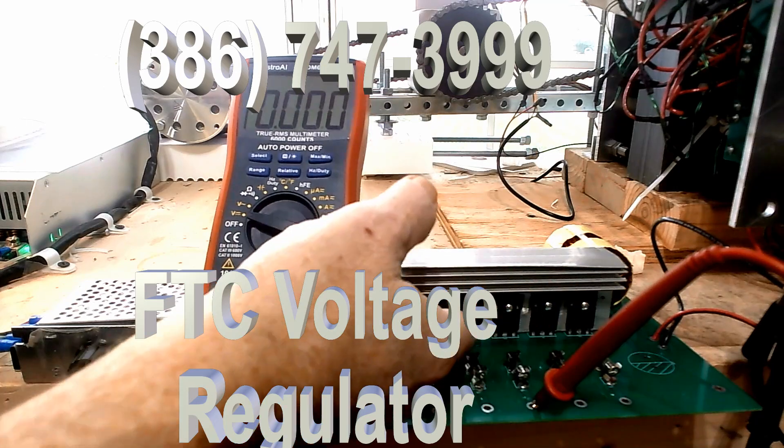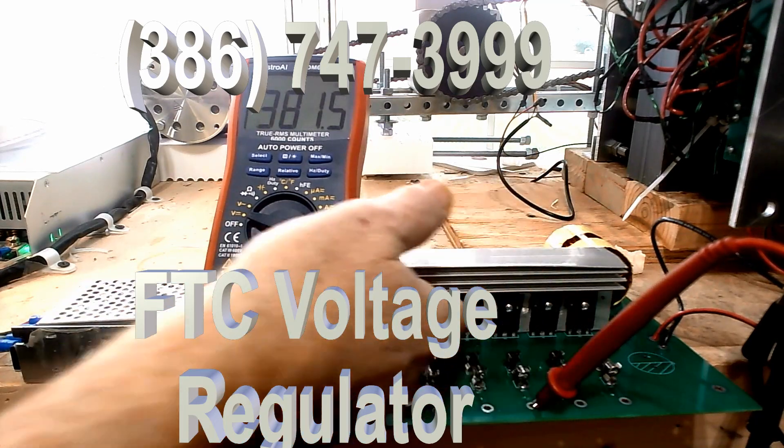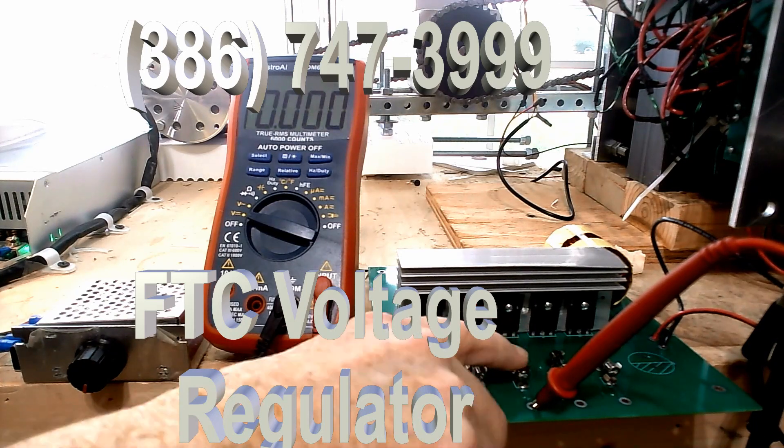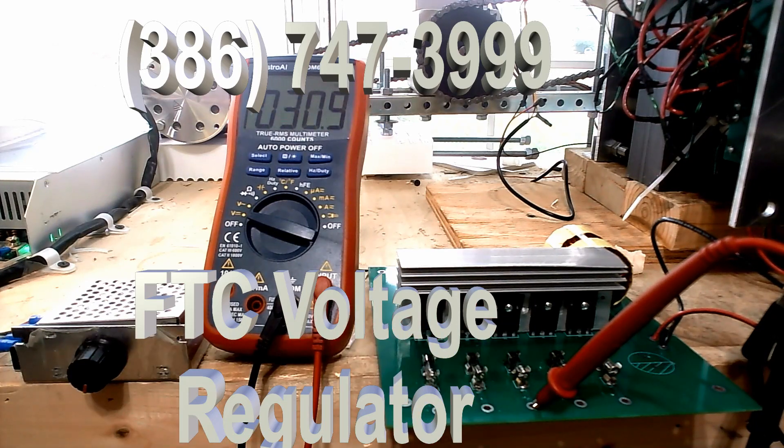What I've got here, these MOSFETs — metal oxide semiconductor transistors — are rated at 600 volts and 47 amps. I've got it set up so that at 240 volts, it's going to draw about 15 to 16 amps tops into a generator or a Bitcoin miner. These fuses right here are 20 amp fuses. That protects the transistor if there's ever any problems, but there shouldn't be — everything is pretty solid.